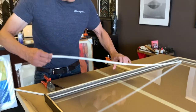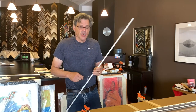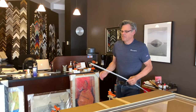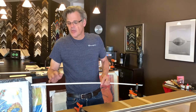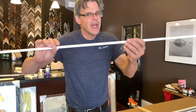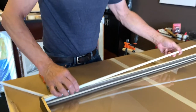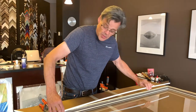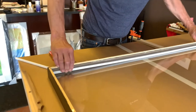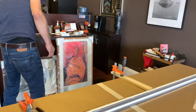That looks good. When dealing with plexiglass or UV glass that has a coating on the inside — actually, when dealing with anything other than regular glass — this has double-sided tape on it. You cannot get this double-sided tape on any part of the plexi that shows, or you've just ruined a couple-hundred-dollar piece of plexiglass in this case. So I hold it firm against the edge and push it straight down, and that is it — that's how you install the spacers.